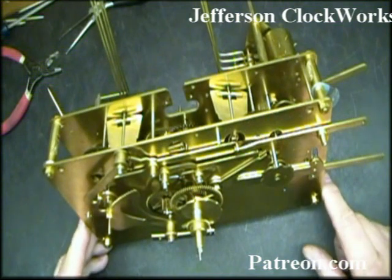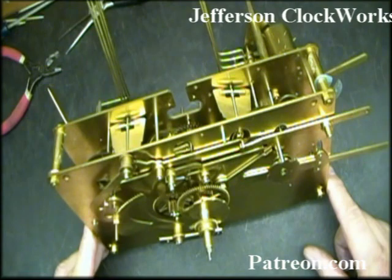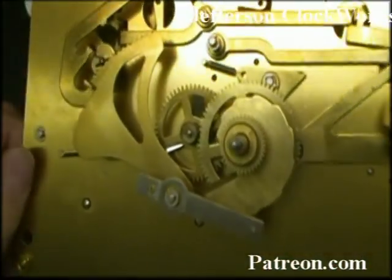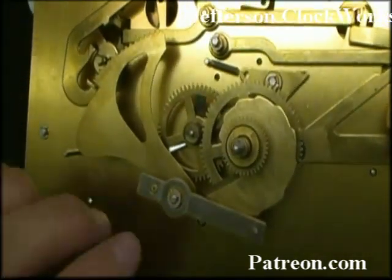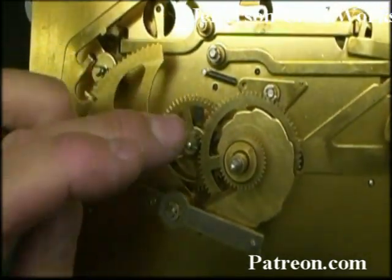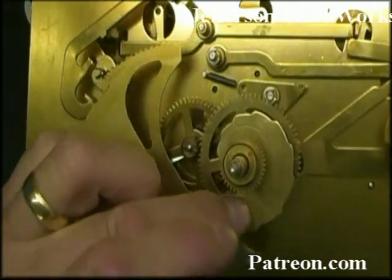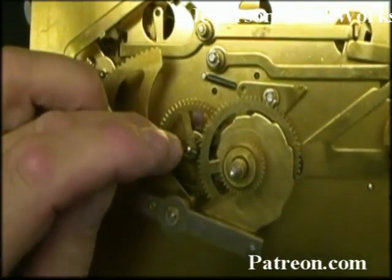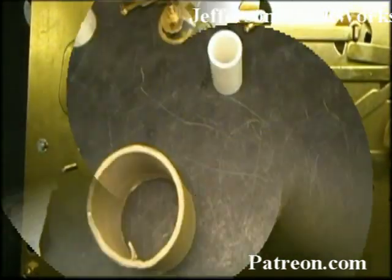What we're going to do now is talk about how to set up the movement so you can look at the timing marks and copy them down. Now that we've finished discussing the timing marks, it's time to start taking things apart. There is one more timing mark I like to note — the relationship between the minute arbor and the hour arbor, which also contains the snail assembly. I like to have that aligned just the way it is right now, and as we take apart this area I'll show you exactly what I mean.